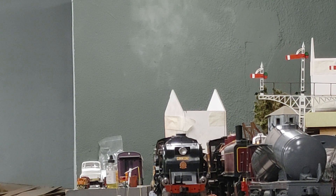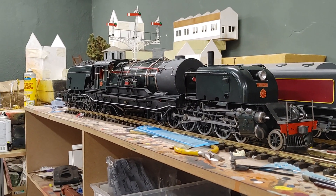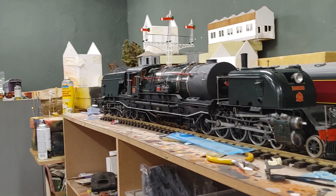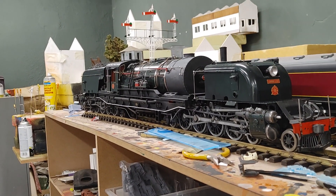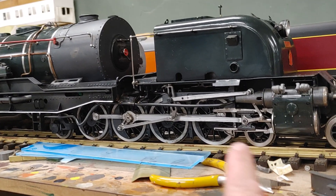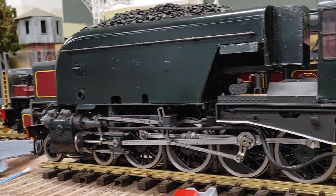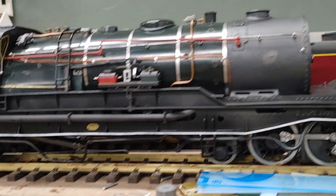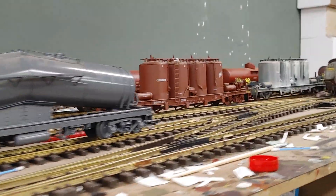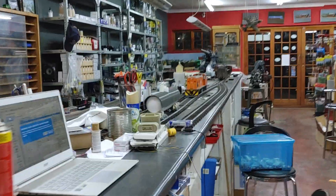Okay, we got that out of the way. Now a lot of guys also asked me what the hell is articulation. A Garratt, some of the Mallets that are not compounded, and obviously like a Big Boy and stuff like that — it's basically two locomotives on one chassis. You have a set of drivers here with two cylinders and a set of drivers there with two cylinders. Essentially two locomotives on one frame, with only one exhaust. It will stumble over each other, for lack of a better word.